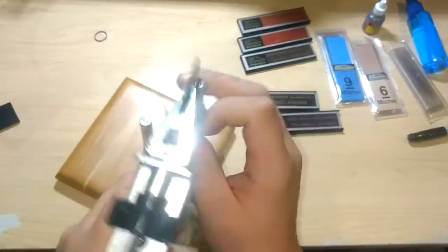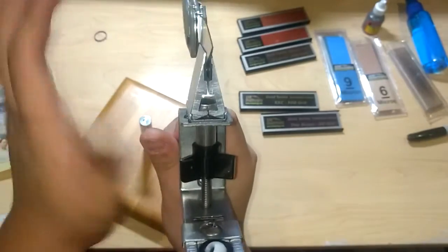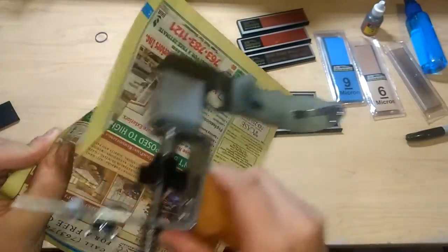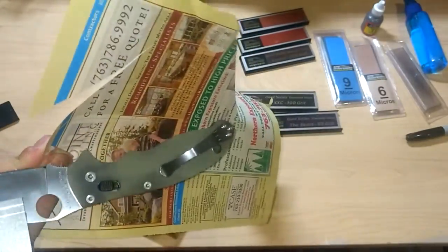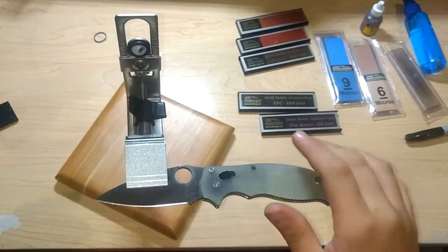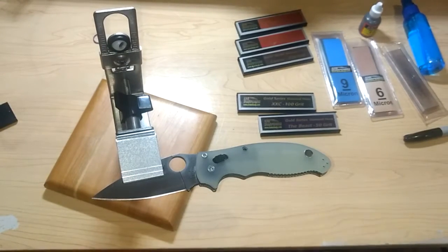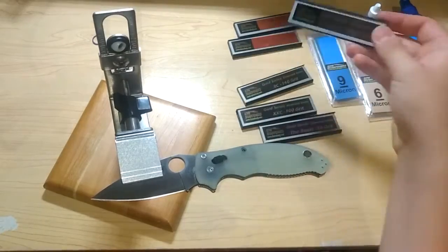And this knife, the way to test sharpness on the KME, make it so basically the knife is vertical, so you have the most convenient control. Hold on to this. And this is very easy to test sharpness. It was sharp at the 100 grit. It was just so toothy. I mean, no one's going to stop at the 100 grit, really, are they? Probably not. If you're stopping for basically the toothiest edge you can get, I think the edge cleans up the most at our next stone, the 300 grit.